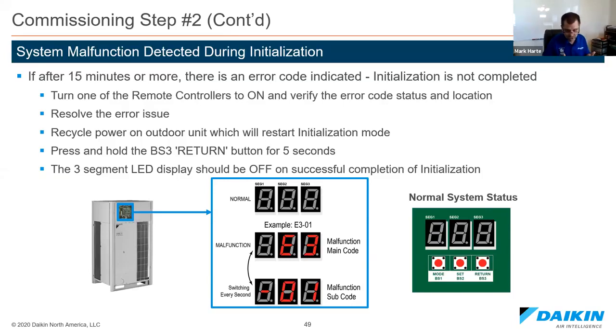We have a service checker tool where you hook up from your laptop — it's a module that connects via two-wire to the outdoor unit. You can see about 45 data points from the outdoor units and about seven or eight points from each indoor unit, including expansion valve positions, rotations per second, fan RPMs, valve open/closed status, and EEV pulse values. We offer a Service Checker Level 2 class that teaches technicians how to read that data, conducted in-house only because you need to be on actual equipment.